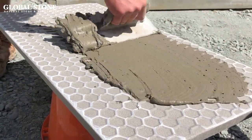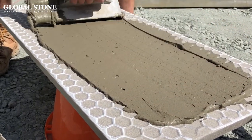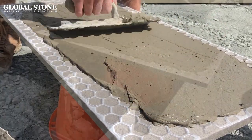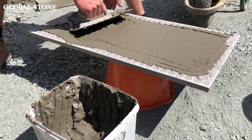Adhesive is strongly advised to form a bond bridge between the wet bed and the paving. If an adhesive is not used, the porcelain will not stick to the base and will become loose. Ensure that the adhesive reaches the edges of the porcelain paving. Remember, apply the adhesive honeycomb side up.